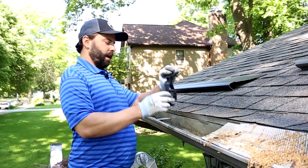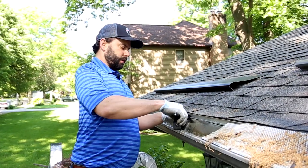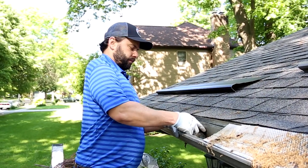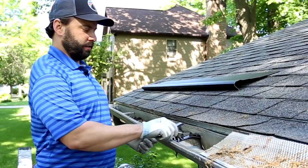The TruGuard bracket clips inside the lip of the gutter — see how that's locked in there. Turn it to the left towards you and then turn it to the right, and you're all set to screw it in. The bracket is now in and it's completely firm.